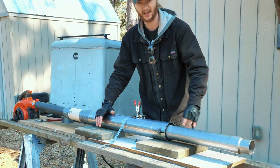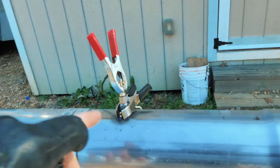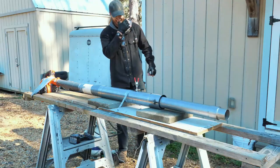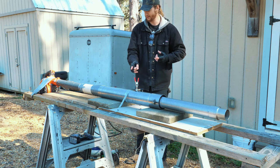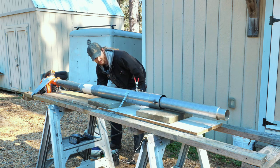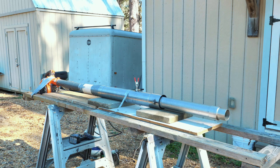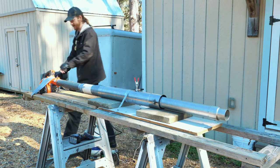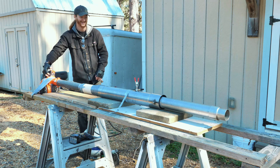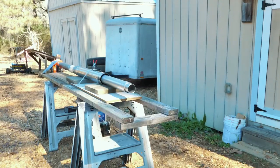This is the stupid monstrosity I have created. I've got it strapped down to the table — unless we're generating obscene amounts of thrust, which we won't be, it shouldn't fly off. The glow plug is hooked up to a 12-volt lawn mower battery with an on/off switch, and propane is connected. Let's turn the glow plug on first to heat it up, then turn the propane on a little to get ignition. There was a fireball — not enough oxygen in the tube, so the propane built up and exploded out when I turned the air on. Let's try again.